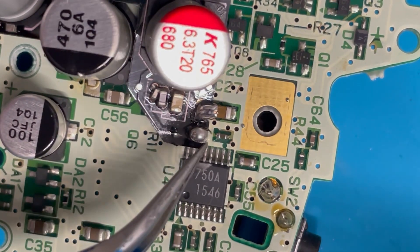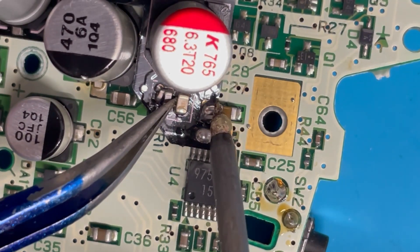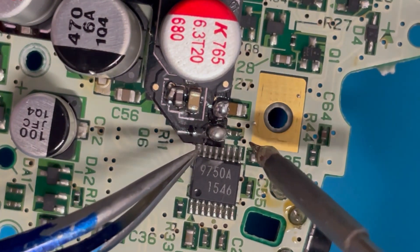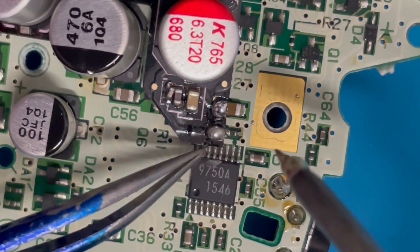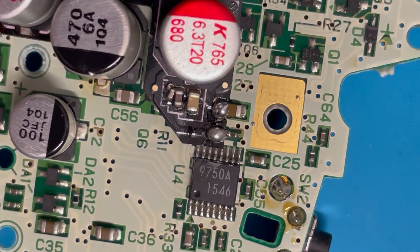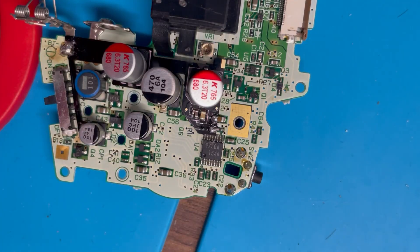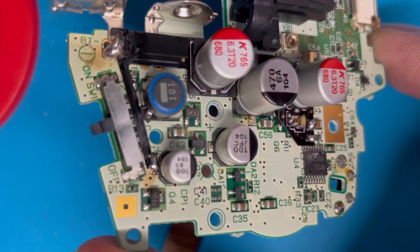If you notice there's a huge gap between this capacitor, just gently warm up and push forward so it's nice and close. It's important to be close because that's what's going to get it to join — if you have a gap, this will never solder. For the tiny one, be careful not to solder any of the nearby pins. Point your solder down this way if you're not comfortable, then gently touch and it will bridge over. You can use flux to help — it's not necessarily required but it does help.